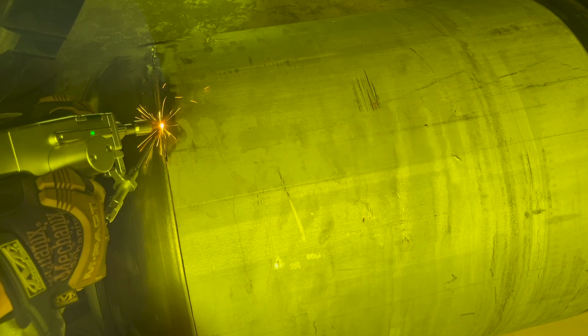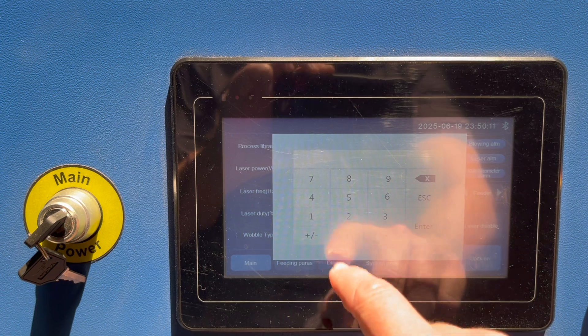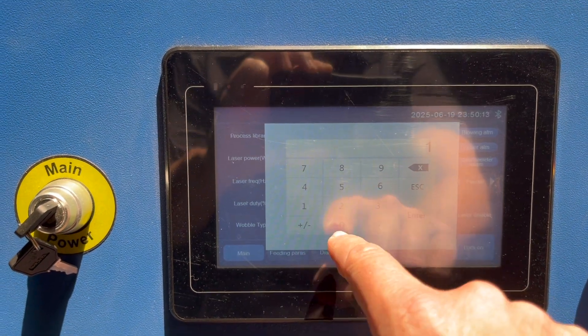If you're filling a gap, use the J technique where you're heating up the thicker part of the metal and pushing the wire into the gap. Also, speed up your wire feed — I usually speed it up about two millimeters to fill up an eighth-inch gap pretty easily.